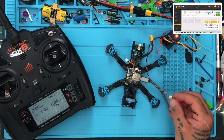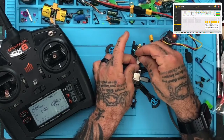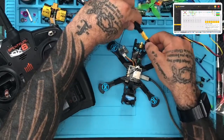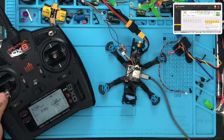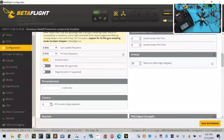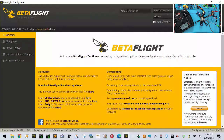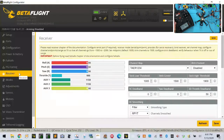So now I'm going to take this off and go ahead and plug it into the quad. And here we go. So now we're going to wait for this — and there you go. So now, look, I'm going to go up to configuration in Betaflight. I'm going to drop down to 1024 instead of 2048, click save. And when I log back in, I've got a solid signal and I'm back to normal.